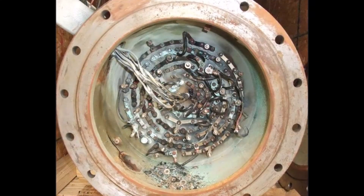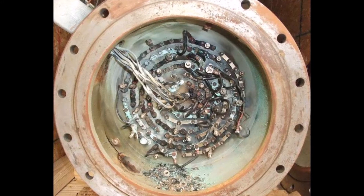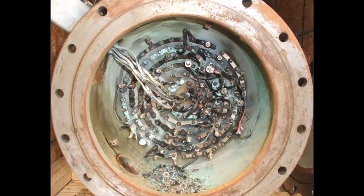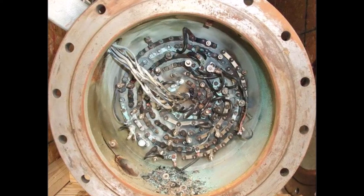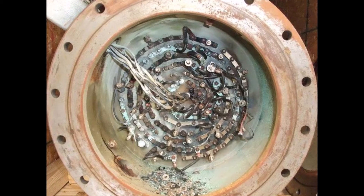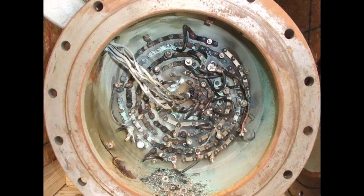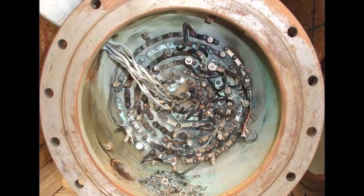EML Manufacturing receives various heater bundles for testing and repair. In this instance, the bus bar became loose and the hot wires created an arc, burning up several of the wires in the bus bar and the insulation. To test this, you would remove all the bus bar and rather than conducting a test on each circuit, you would test each element individually as we showed here.